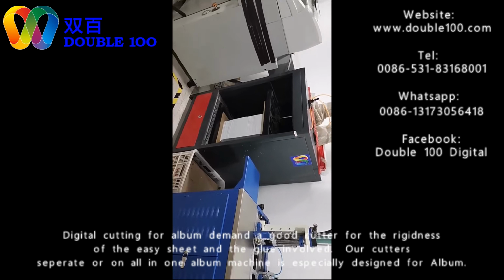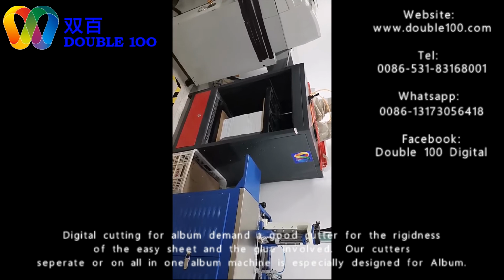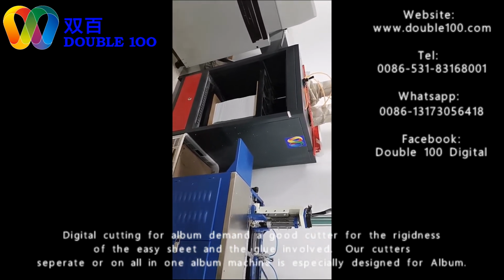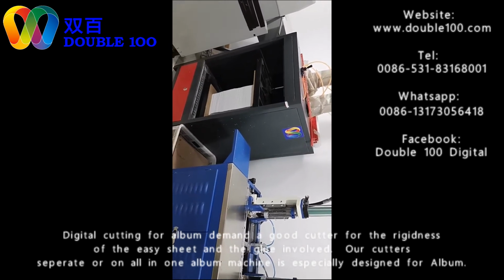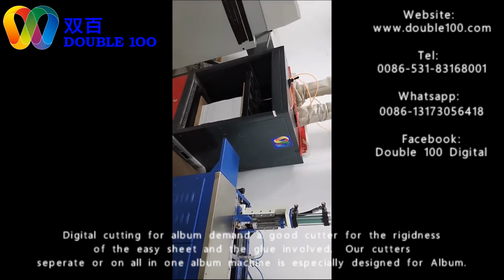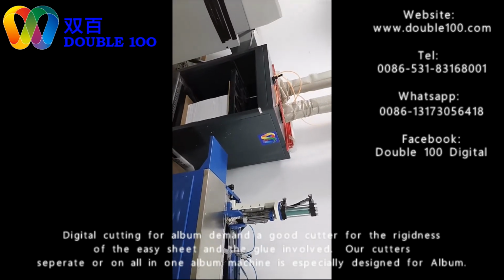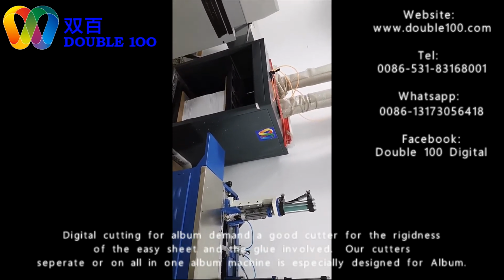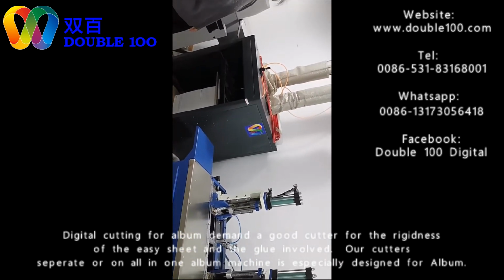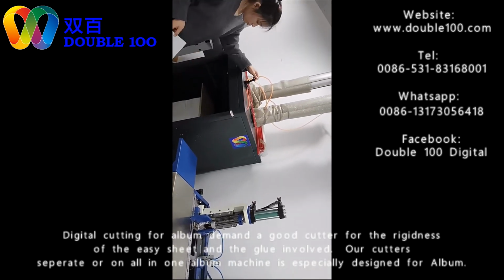There are different machines for cold pressing. We have the manual one, manual cold pressing. We have magnetic pressing. We also have this kind of large quantity pressing together. After pressing, we will come to the next step, edge polishing or gilding or round corner. Sorry, there's one step missing. After pressing, we need to cut the edge for trimming.